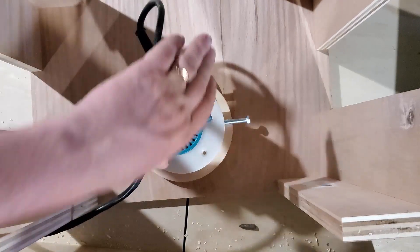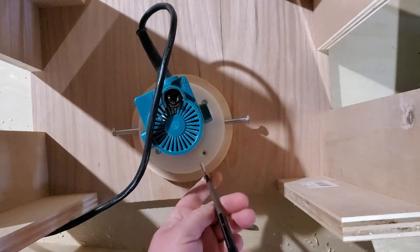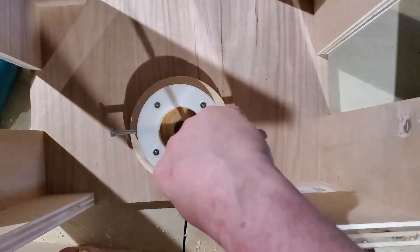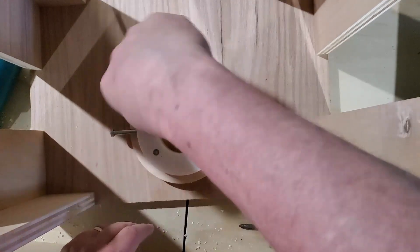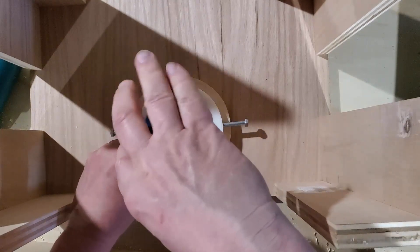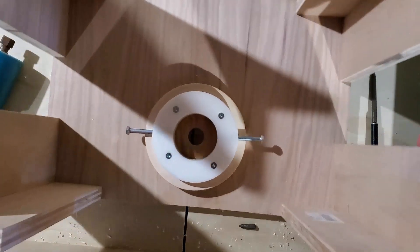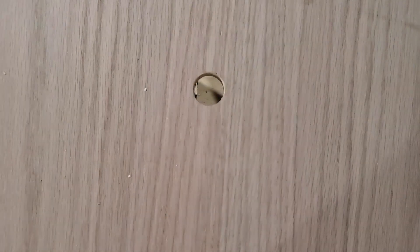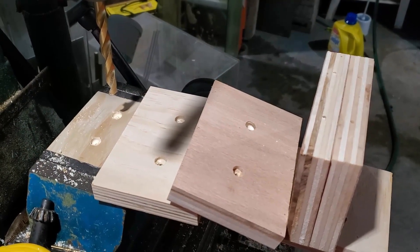You can do a round-off on wood quite easily and it doesn't leave any marks, but you can't do that with acrylic. If the router bit's little round bearing were to rub up against the acrylic, it will not only scratch it but also partially melt it — so that can't happen. I'm going to make a fence off camera. The fence is going to be offset and will have a vertical part which is what I'll rub up against. That's the only part that's going to touch the acrylic, so I don't have to worry about heating the acrylic up.